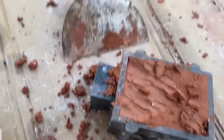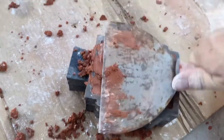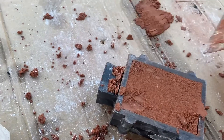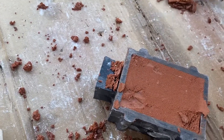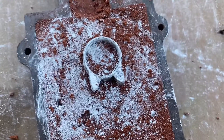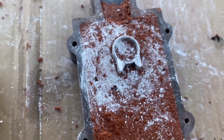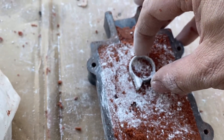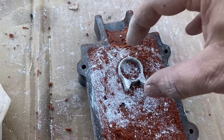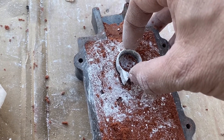A little more to complete the mold. Once it's packed in, it's not going to slide out of the frame. Some people like to scrape off the extra to make it nice and perfect. Opening it up - sure enough, we have a nice pretty mold. The trick is to pull the object out on the other side. Get a little wiggle to make sure the core is stationary, then pull it straight out - if you don't pull it straight out, you'll screw it up.